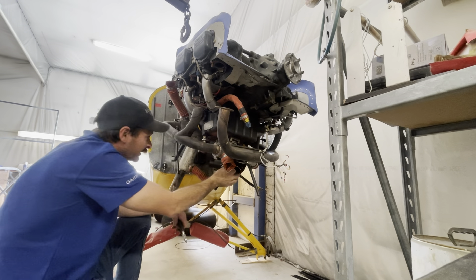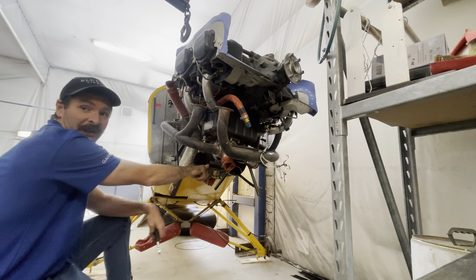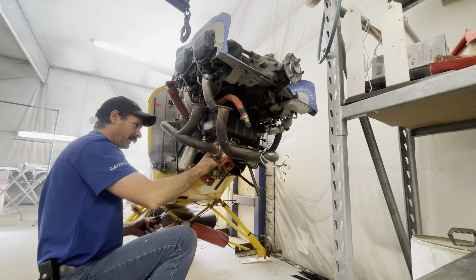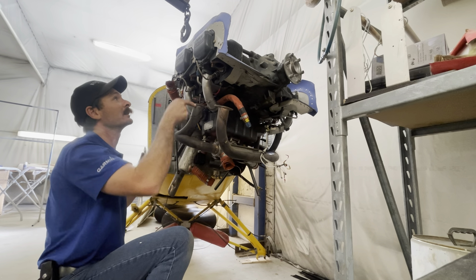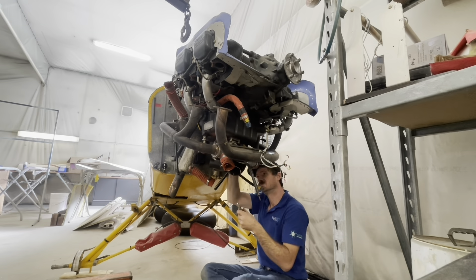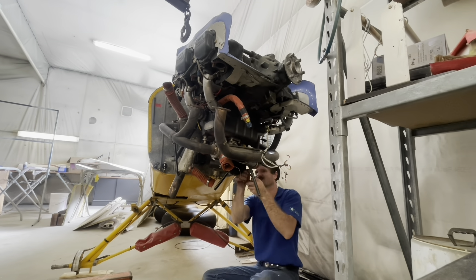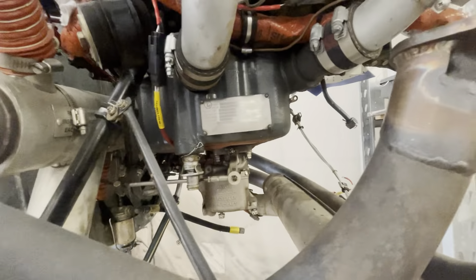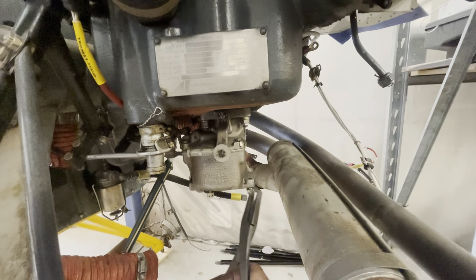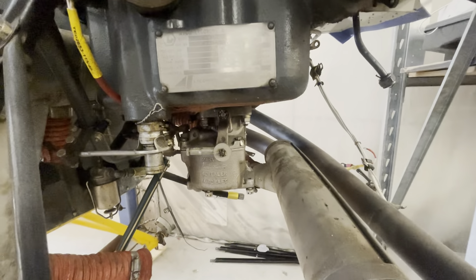In under here we've got the air filter — that's normally straight. The air filter goes on there for normal air intake, and carb heat air intake there. We'll just remove that bit there, because that's all the exhaust is sitting on, and then the exhaust can swing down around the engine mount and we can lift the engine off above it. Just about got the last bits removed — this here is the linkage to the throttle cable, so we'll disconnect that so nothing else is attached to the carb, and we're right to lift it off.